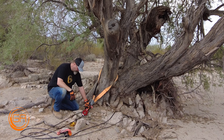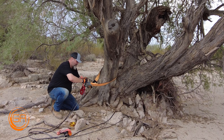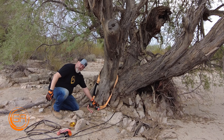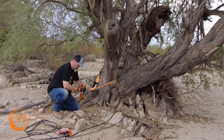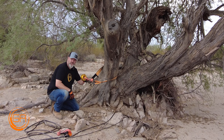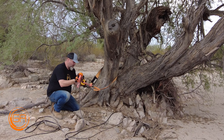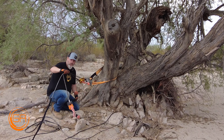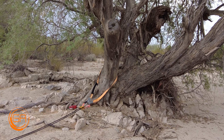Next I'll show how easy it is to hook up the gold ring. We'll unhook the snatch block — disconnect it from the tree saver, take off the snatch block, release the plates and you're free. With the gold ring it's a little easier: attach the ring to the tree saver first so you're not fumbling with plates. The gold ring is already hooked up but there's enough space to feed the winch hook right through it, even with the soft shackle on it, and you're ready for winching.